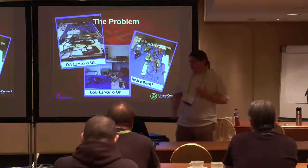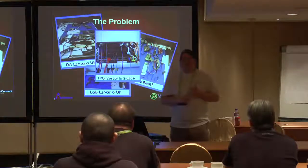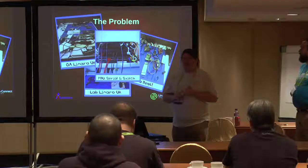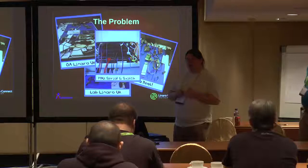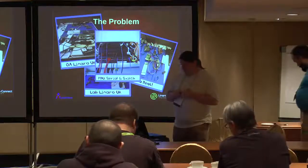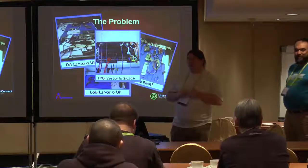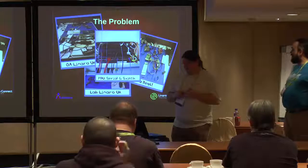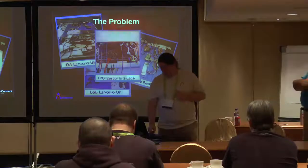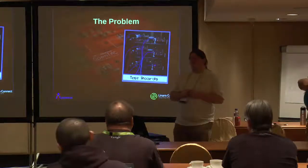And at this point, we're starting to see, in order to provide automated testing, you need some sort of power distribution, something you can turn on and off power from individual units. You need a serial terminal server, because if you're lucky, you may have a serial port on your PC. These days, it's usually hanging off USB somewhere. But if you've got half a dozen units to test, a rack full of them, a lab full of them, you rapidly end up relying on serial over Ethernet and some sort of packet switch. So it can be a bit of an issue. It certainly becomes a bigger issue by the time you end up putting everything into a rack.